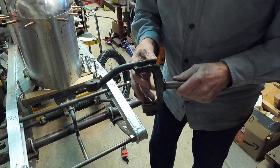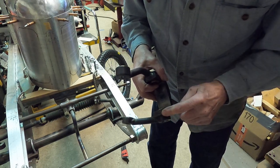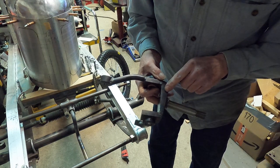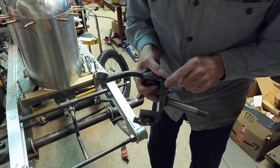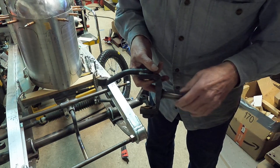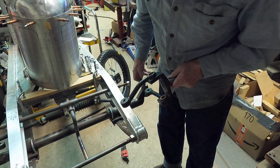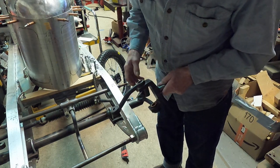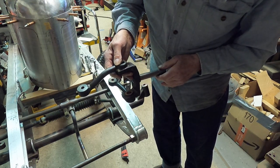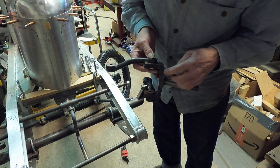The spindle itself is just inch-and-a-half by half cold rolled steel for the upper parts. The lower part, the upright, is three-quarter thick inch-and-a-half cold rolled. The angles milled in here are for the steering geometry — I use eight degrees on the kingpin inclination and give it about two degrees positive camber. That's all figured in with the machine work on this.